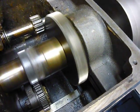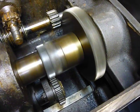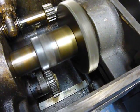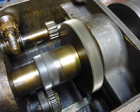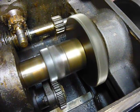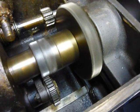But now in the digital era, here inside the headstock I'm going to be installing a gear tooth sensor — actually three of them — and I'm going to configure them so that they will create an absolute encoder, a quadrature encoder. The idea is it'll generate one index pulse per revolution, and then quite a few pulses for good resolution that are quadrature — two pulses out of phase, so it can tell whether it's moving forwards or backwards. Eventually, the CNC PC running Ubuntu Linux and EMC2 will be used to drive exactly the spindle RPM that I want, so the actual VFD frequency-to-RPM mapping really won't matter in the long run.